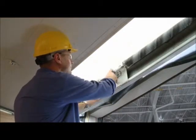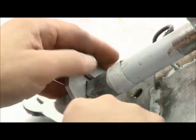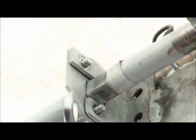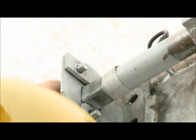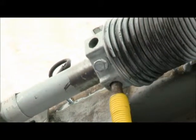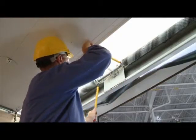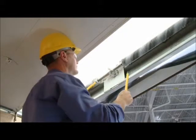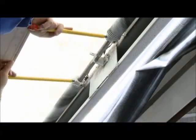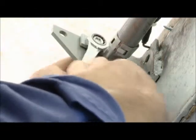Using a 1/2-inch wrench, undo the 2 nuts on the balancer center bracket that's located at the midpoint of the Whiting balancer. A new balancer center bracket will replace this bracket shortly. Insert a 3/8-inch diameter rod into one of the round holes on the balancer spring winding cone. Ideally, use 2 rods to maintain the tension on the balancer spring before the new bracket is installed. Adjust tension as required. Once the desired tension has been achieved, install and secure the new balancer bracket that's provided in the CommandLIFT box.